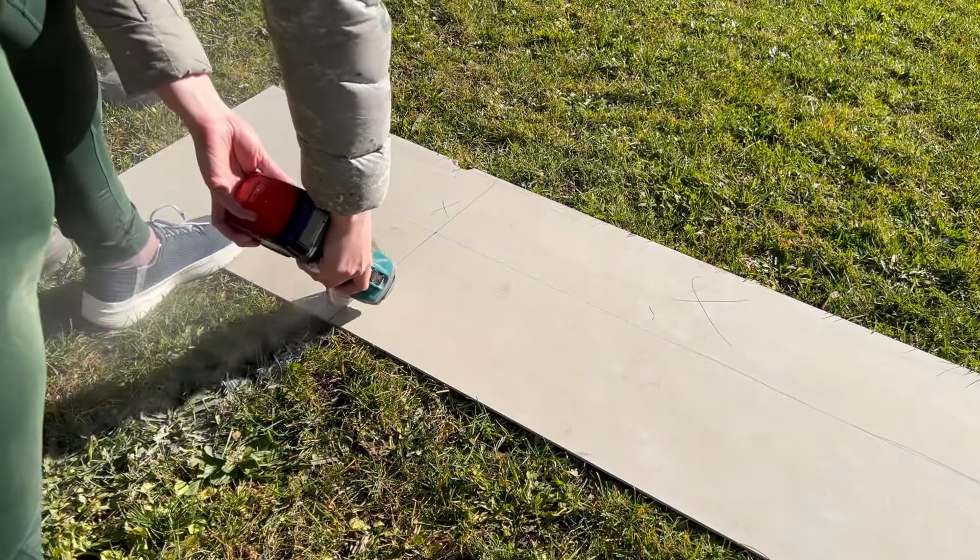Because I ended up tiling almost all the way to the ceiling, I just had the cornice there that I wanted to do a little bit of a paint touch up on. So I grabbed the ceiling color and the cornice color and went along and just painted one coat on the cornice. Then I couldn't forget about grouting the floors — I went along and gave them a good sweep first to make sure there was no dust, then grabbed out the grout and used the grout trowel the exact same way I did on the walls, pushing the grout into all of those spaces in between the tiles. I left the edge strips where I was going to apply silicone, so I didn't apply the grout right up along the edge of the shower base, along the edge of the bath, or along the edge of the vanity.